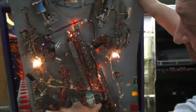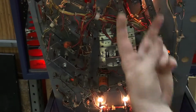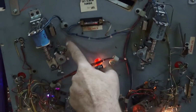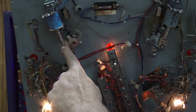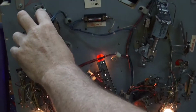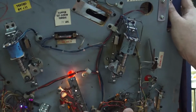Good. We took the drop targets apart and cleaned and burnished the horseshoe switches. They're always a mess. We put new parts in the flipper, also one new flipper coil, new end of stroke switches. You can get the long blade end of stroke switches, for the correct fit for these. We also got new plungers and links, courtesy, of course, of Steve Young. He makes these fiber links, new coil sleeve on the coil we didn't change. Now the flippers are fully responsive.